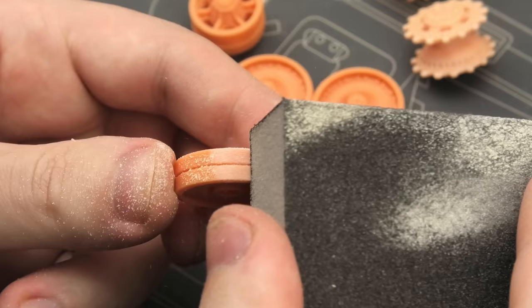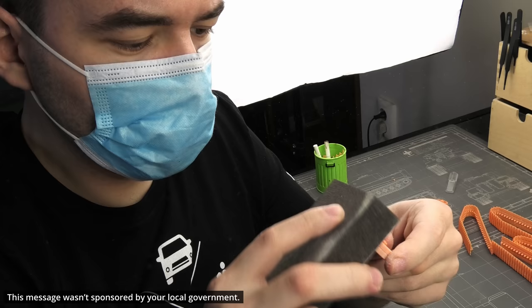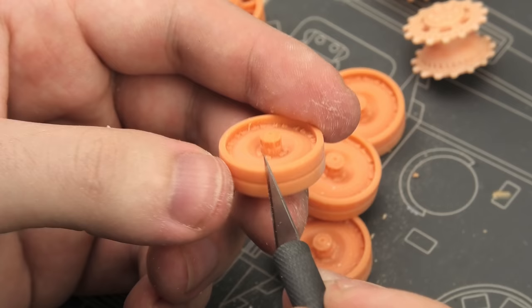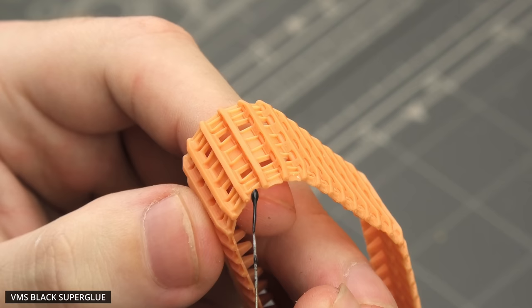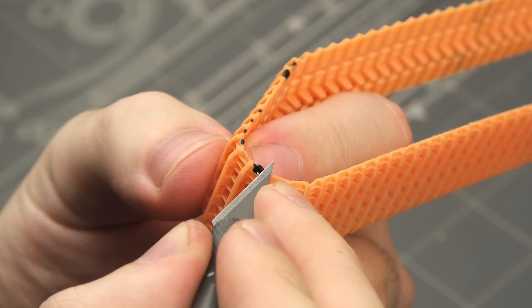The next obvious step is the cleanup. Luckily, the resin is very easy to sand, and here we can hit two flies with one stone — get rid of the support remnants and also knock down the subtle layering which is always gonna be present on 3D printed models. Resin produces a metric ton of dust, so it's important to protect your breathing. Resin is also very brittle, and it's very easy to damage — by accident or on purpose — which makes adding realistic damage to the rubber cladding on the wheels a walk in the park.